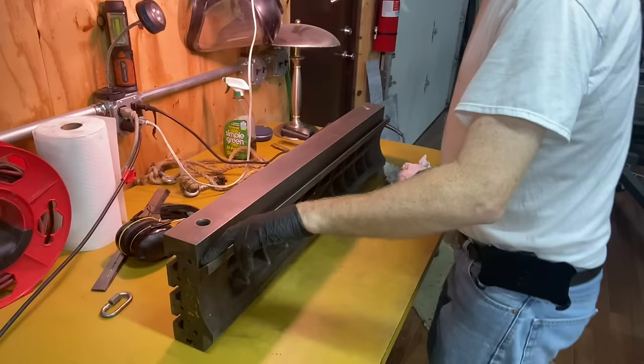The undersurface of these T-slots is generally dirty. I've tried going back and forth cleaning them — they were really dirty when I started. Sometimes there's still a little bit of stickiness, but it feels like it's going right past that. I think we're good. This next one makes me very anxious, but I've already done it with one of the smaller holes and it worked out pretty well. I'm going to drill it deeper, tap it, put a bolt in, Loctite it, and mill the top. I hope I'm not screwing things up.